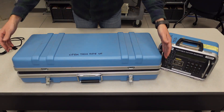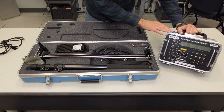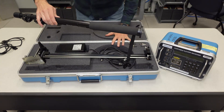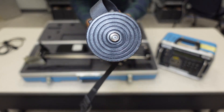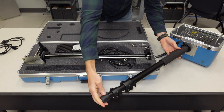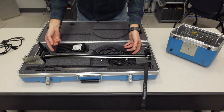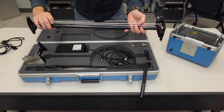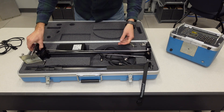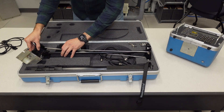This is everything we need for our portable ILS receiver. We're utilizing the Talus model 7010 PIR today. In the antenna kit we have our monopole with the quarter-inch camera mount that threads onto the base of the PIR so we can carry it around when doing ground checks. We've got our localizer antenna kit with the longer dipoles — that's how you know it's for the localizer — and the short dipoles for the glide slope, which is all a function of carrier frequency.